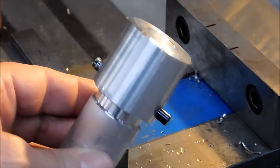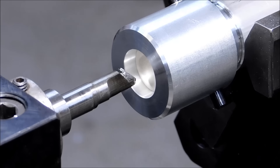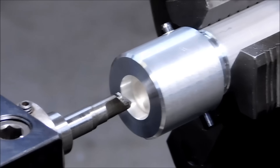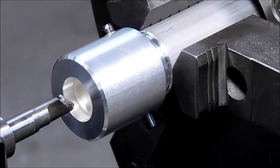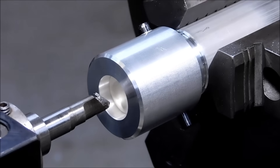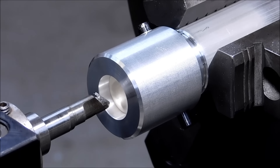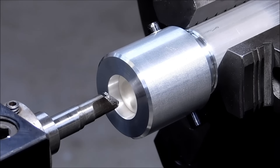Let's put it back in the lathe. The hole in the cap is the end diameter hole I want in the shims. So when the boring bar gets close to or starts to touch that, I know I am right where I need to be. Let's load it up in the three-jaw, bore it out, punch the pin out, and see what we get. The entire arbor assembly is back in a three-jaw chuck. I indicated the part of the arbor that is inside the cap.